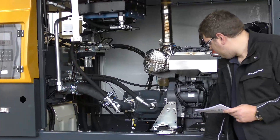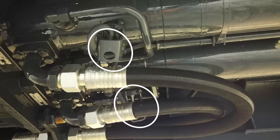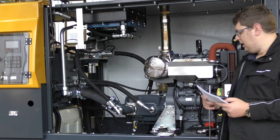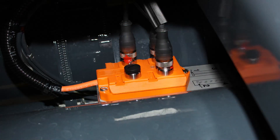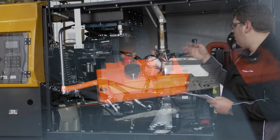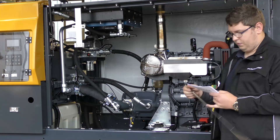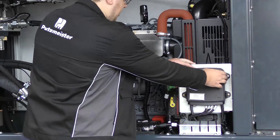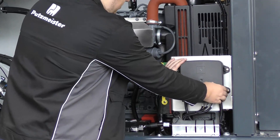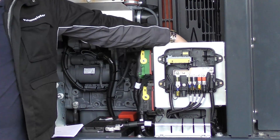Below the drive cylinders you will find three magnetic switches. The magnetic switch distributor sits between the cylinders on top and the cable runs through the wire harness for the engine to the control unit. Behind this black box sits the Deutz controller, which is mounted in the rear.